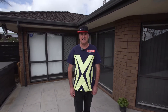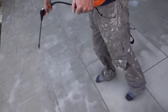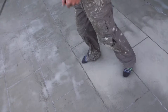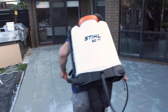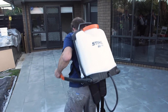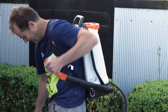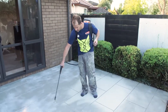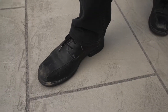The sealer we're using today is Ardex WPM 163, which is a really simple water-based sealer. The first coat goes down diluted with 10% water, and also acts as a curing compound on the fresh colorate system. The final two coats can be applied the following day. It makes the surface a lot easier to keep clean and maintain and it's going to stop permanent stains from spills, leaf debris, that type of thing. We've provided a rustic trowel effect to the surface which has made it very non-slip.